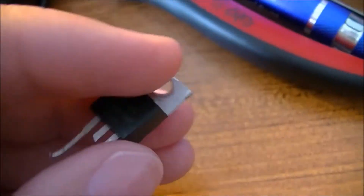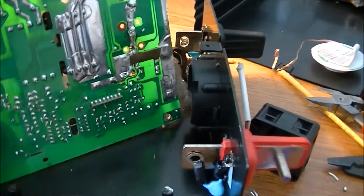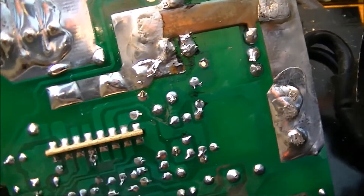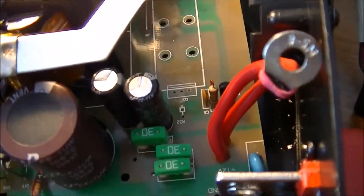This one is still good; the other one went bad. I'm not really impressed with the inside of this — the PCB hole is pretty bad, there's barely any copper left. When I get the new one in, I'll just have to bend the leg over and melt the solder in. Also, when I was desoldering, I unscrewed one from the heatsink and it was already loose and flopping around — I hadn't even touched it with the iron.